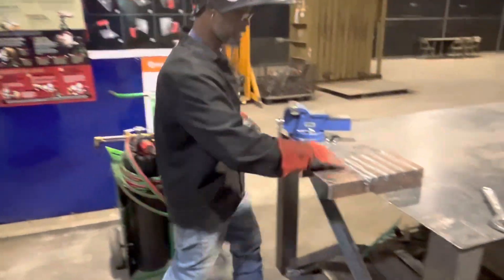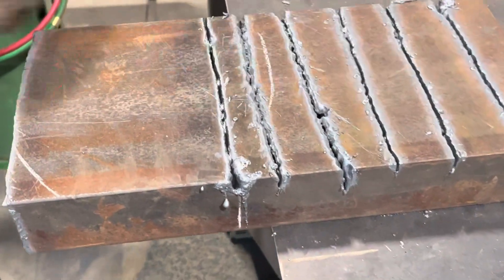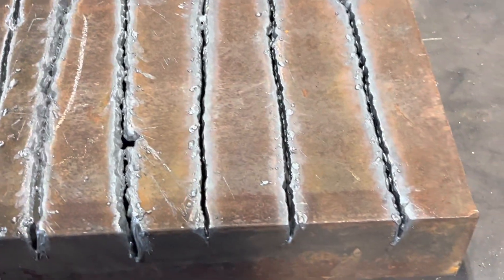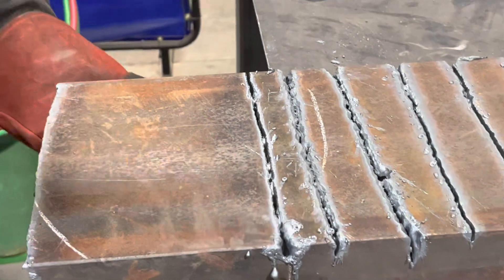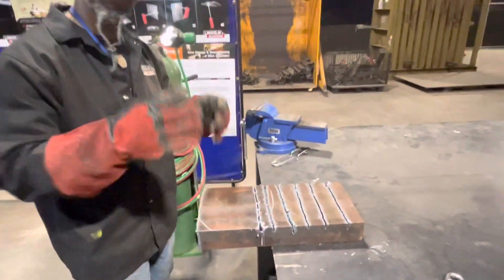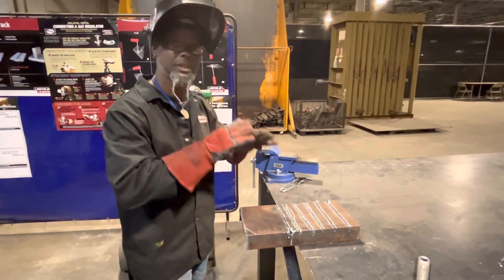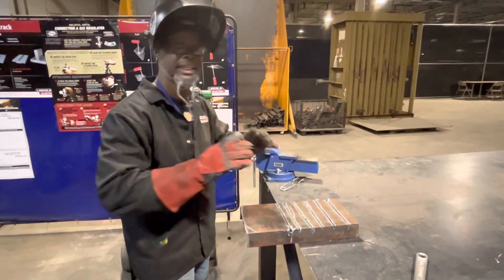I want to show you what this cut looks like. I just wanted to give you a straight line — it'll take some practice, so get some scrap and just practice cutting. If you're cutting correctly and your angle is right, you won't have a whole lot of slag. If the slag is real thick at the bottom, that means you're running low on oxygen, which keeps it from cutting all the way through. Because the oxygen is actually what cuts the metal — the fuel gas heats it up, and then when you hit that trigger, the oxygen is what's doing the cutting.